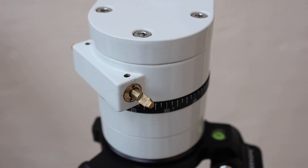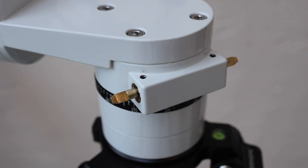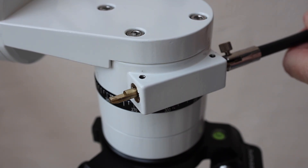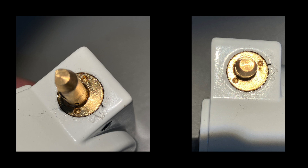As I showed in the previous reset and repair video, you do not need to take apart the core of the SV-225 mount to make the corrective adjustments. The brass component you see here is the worm gear housing of the azimuth drive. There are protruding connections on either side where you attach the hand control rods for providing rotation and sky navigation. If you look closely at the gear housing, you can see that the worm gear brass housing is intentionally asymmetric in design, and on each side of the protrusions there are little indentations separated by 9 millimeters of spacing, made for spanner wrench tips so that you can spin the housing to force the two gear mechanisms back into closer contact.